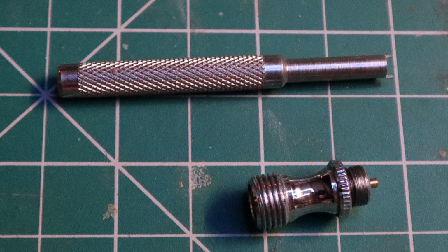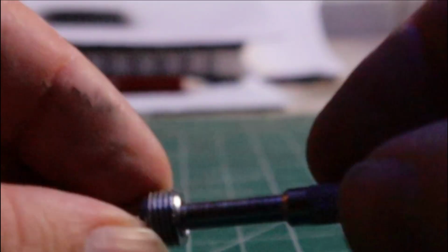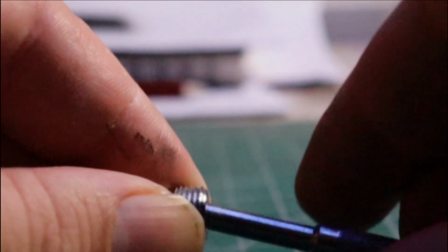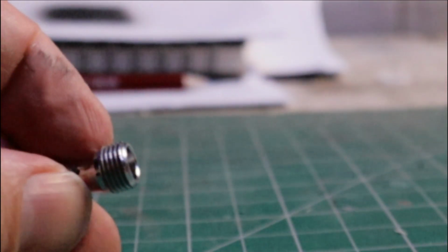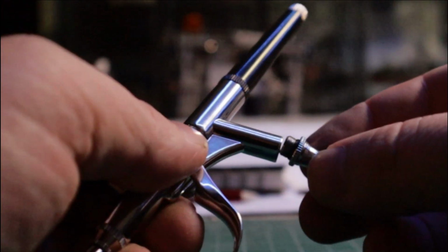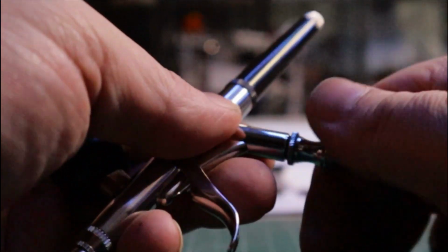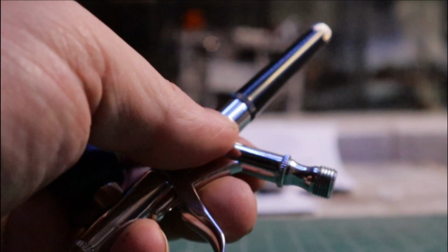By design, this goes onto a portable compressor and is single action. Air will run constantly no matter what. With a spare standard 1/8 inch air valve from a Hseng and an air valve tool or tweezers, remove the brass plug from the input, and the assembly of an O-ring, brass rod and spring will come out, thus converting the valve into an adapter. Threaded on, air will pass through, and now this can be operated on a standard hobby air compressor.